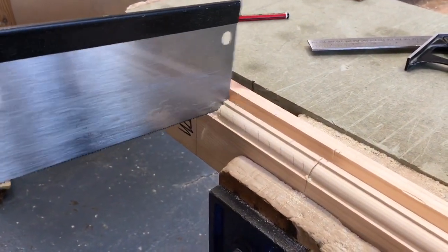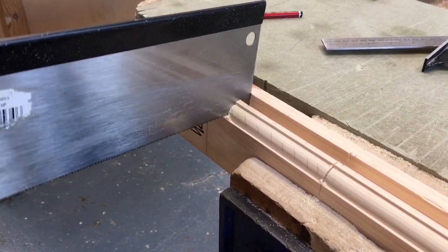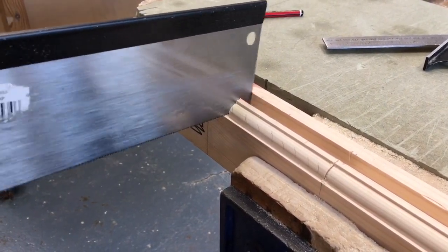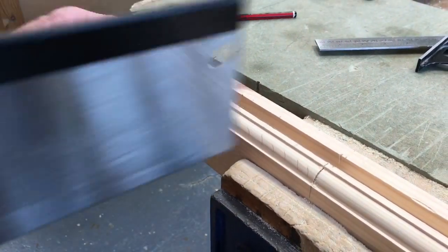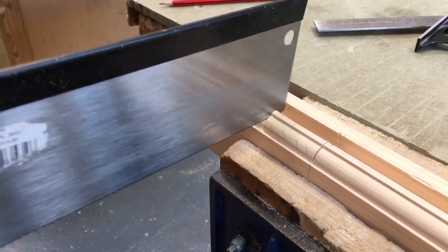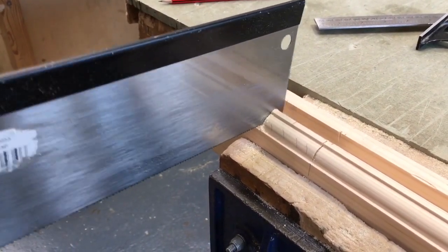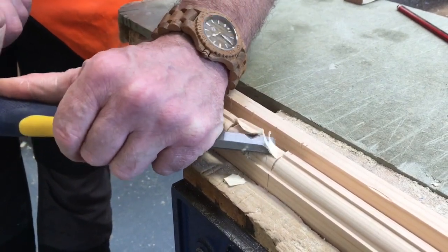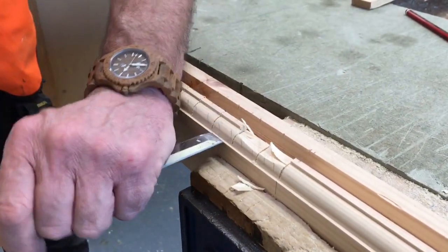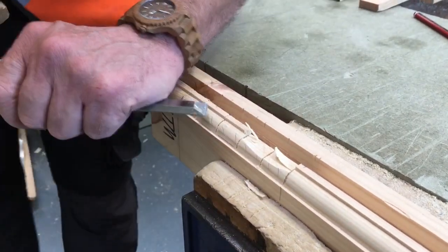If we don't cut it loads of times like that, we're reliant on that grain. And if the grain runs downhill and I try and chop it between there and there, and that runs down, I'll lose the battle. Just be really sharp, it doesn't normally put that line into that. Just go diagonally, like that, so that you can control how much comes off. If you hit it like this, straight away, that's just going to break out. You need to control it.